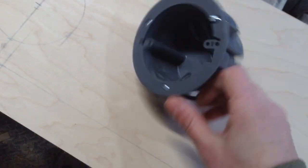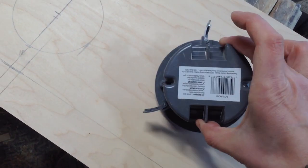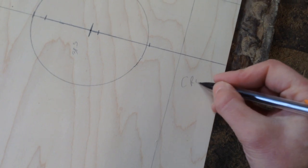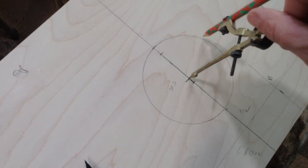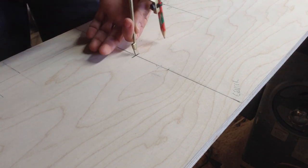I got these boxes — they're almost like toggle bolts, they're designed for ceilings. But since this doesn't have any studs to attach boxes to, that's what I got. And then like I said, that's one inch for the crown. And then all I did was just draw — because this is about a little over four inches to fit the boxes — I just drew some circles with my compass. And then I could cut those out. And that's where all of the holes were going to be.